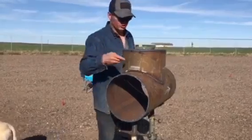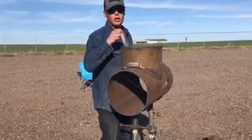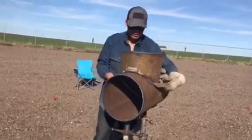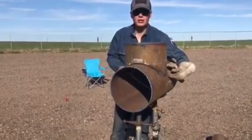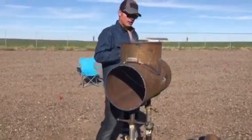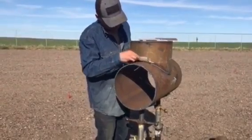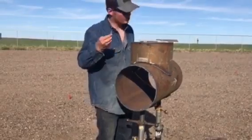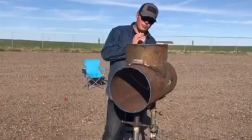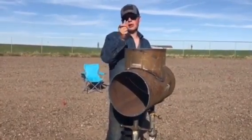So you're gonna wanna make sure that you run your throats first, because you do not want those sucking up. You will trap slag every time. Run your throats first with your root, run these next, your ears, and then finish running the root out on it. That's key. And when you run your strap pieces, you wanna make sure that you run one full rod all the way from end to end. It's gonna keep you from trapping slag. So we're gonna tack this up, and I'll show you how to get it put on your jack stand, and then the rest is up to you guys.